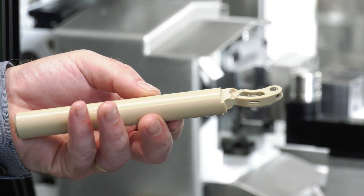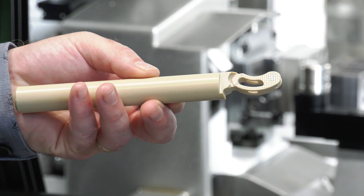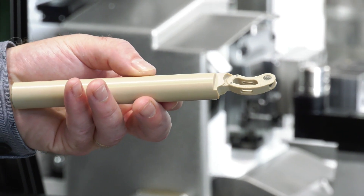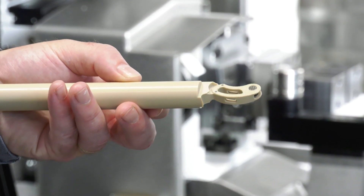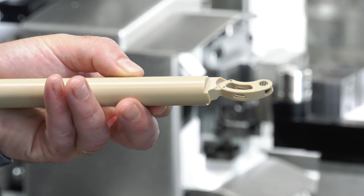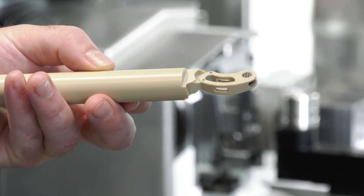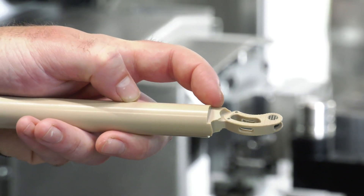So this part — the dimension of the bar will be inscribed in the 36 millimeter diameter. That means we can make all the first machining in the A-axis, by milling, a little bit by turning, and before grabbing the part with the vise. After, we will separate the part from the bar and finish the last phase.